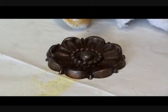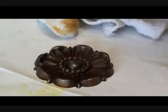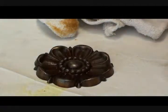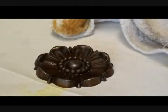The Smart Coat will go over the oil, but you have to let it dry first. You'd have to let it dry for at least a day or two before you can put the Smart Coat on. So you oil it, let it dry, and Smart Coat it, and it should be good for 5 years outdoors. Oh yeah, should be easy.